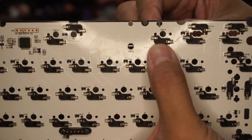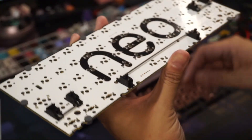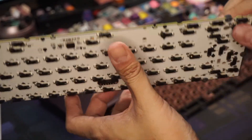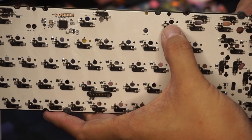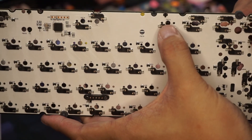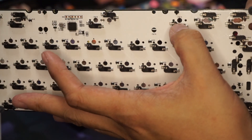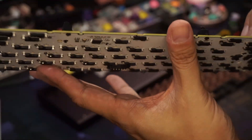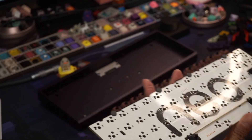Some people have asked me: should you tape this hole up and prevent some of the air flowing through? Maybe — I've never tried it, but that's likely the culprit. So number one: make sure your stab is flush. Number two: maybe tape this up. Don't worry about wire balancing — this is the number one problem right here. You have full PCB on this side and a big gaping hole on this side where only half of the stab is connecting and the rest is pushing through. So you're going to get a spacebar that sounds weird on this side, and a solid clack on the other side.